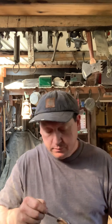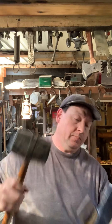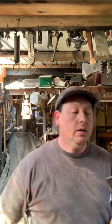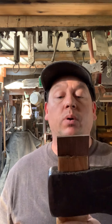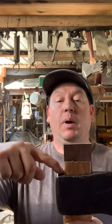I've got a wedge ready to go with a little bit of glue on it — doesn't take much, a little dab will do you. With my trusty rubber mallet, when you're pounding the wedge in, you want to make sure it's not making curls on the side. Sometimes it gets a little big, and at about the halfway point before I start wailing on it, I'll take my knife and clean that up — otherwise it's going to bottom out and snap.